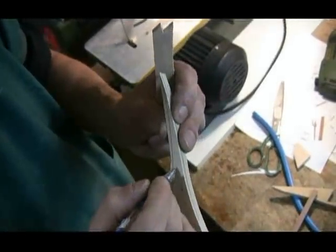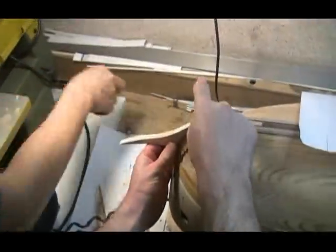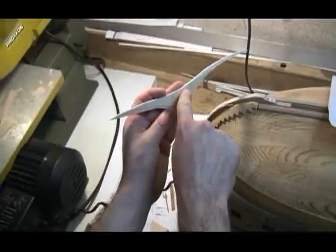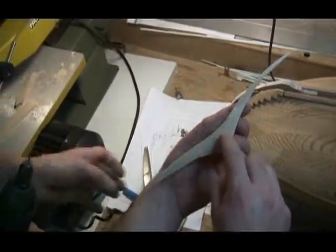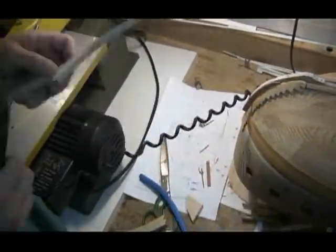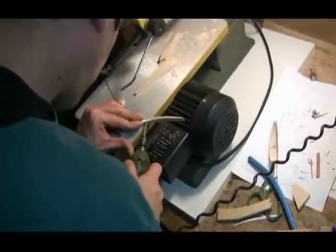Understand. So those nails are going to protrude from here. You won't be able to see them from this side, because remember, this is the actual side that goes on the model, and you don't want to see holes here. So nails will be inserted, distance measured, so you don't go through the end, and then that will connect into that with PVA. Remember, this is all one solid piece of wood. It's not this bad quality wood covered in pear. It's actually solid pear or ebony. Ebony you could cover. I mean, you could use ebony to cover something, but not pear.